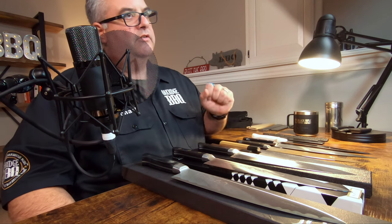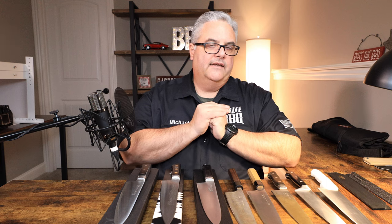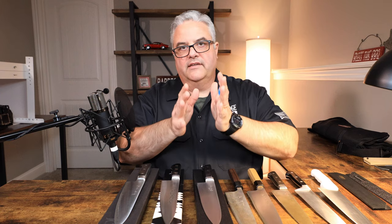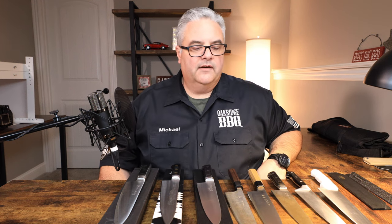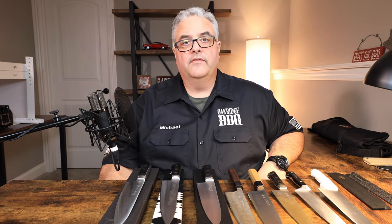A sandwich construction is where you have a soft stainless on the outside, a very hard high carbon steel in the center, and then another soft stainless on the other side. The idea is that the soft stainless on the sides of the knife blade dampens the steel, so you're less apt to literally break the thin high carbon steel core. It also adds stainless properties so there's very little rusting, while the core down at the edge gives you the cutting ability of the high carbon steel.